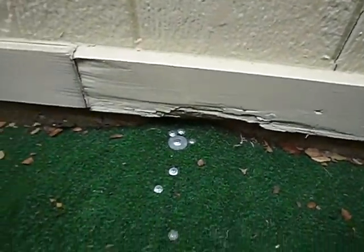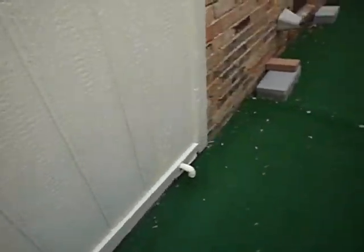We got horizontal trim around a lot of the structure. A lot of it. Here's some more right over here. This wood rot right over this board. Okay. These trim boards, this siding was not installed with these trim boards. That's atypical to this installation. So it's reasonable to assume that there's wood damage behind this. That was put there to cover something up.